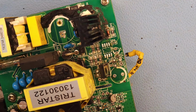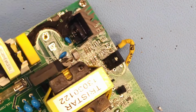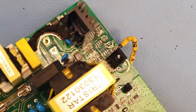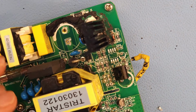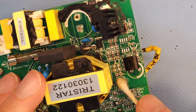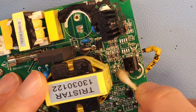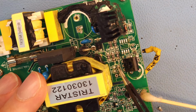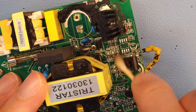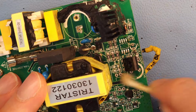This transistor over here, I measured it earlier and it tests quite okay. It's still fine. It's a 2SD669, and it's testing fine. See, here I lifted some traces. They are still there. And these two here on this side, they are connected together. So I think that should still be okay to get this working again when I replace these components.